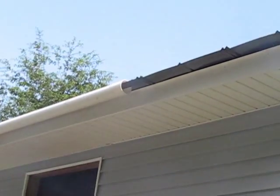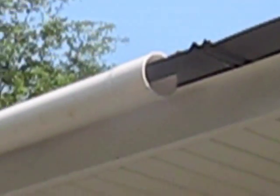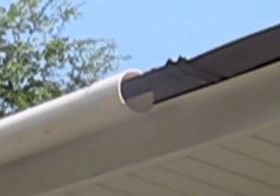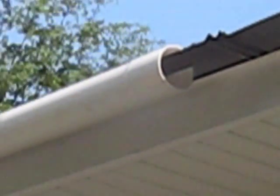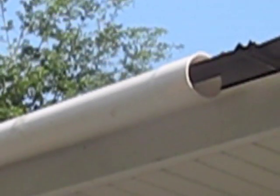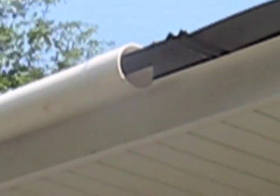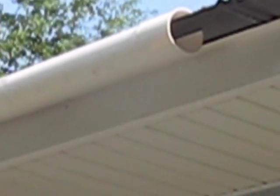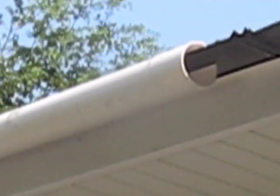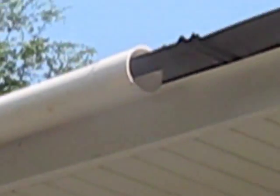This is how you prepare the gutter. Basically, you cut a line lengthwise all the way down the length of the pipe — try to get it as straight as possible. You can see right there how I cut my pipe. Then you separate the two ends and just jam it right onto the roof. It can be a little difficult — you might need to stick some wooden dowels or screwdrivers in there to hold it open while you ease it onto the roof. The reason you want to use three inches or larger is because thinner pipe can be difficult to pull the jaws apart on.